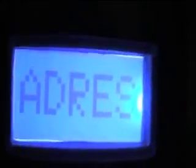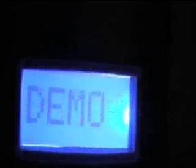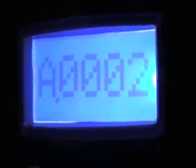So then you go to your DMX lights and slide them both flat. Go in your DMX light, let's turn the light off so you can see, and you see that it says address. You go into the address and the different menus like pan, tilt, focus, demo, LCD, lamp. You go audio if you just want to control it by audio. But you want to go to address. You need to set it to address 1, so you just keep it at 1.